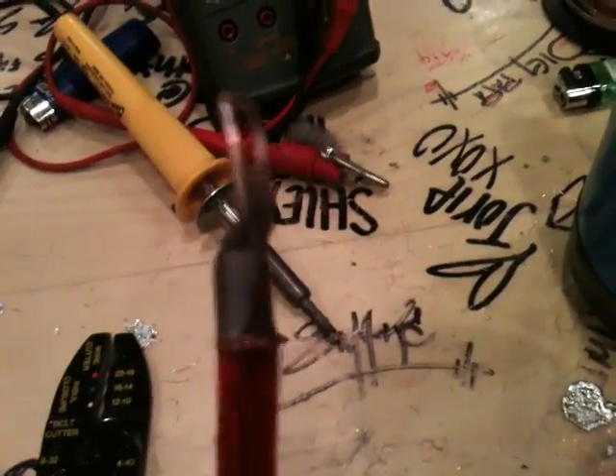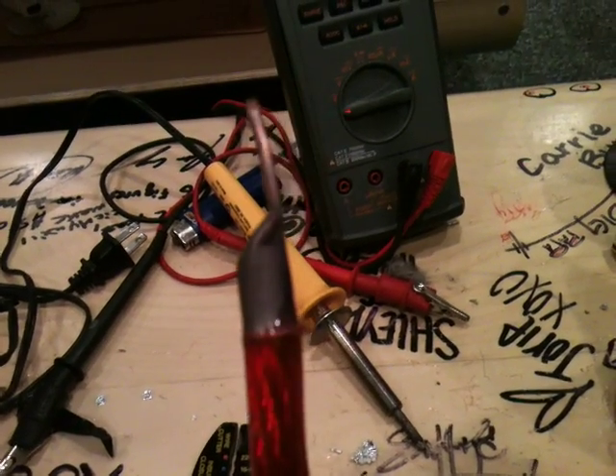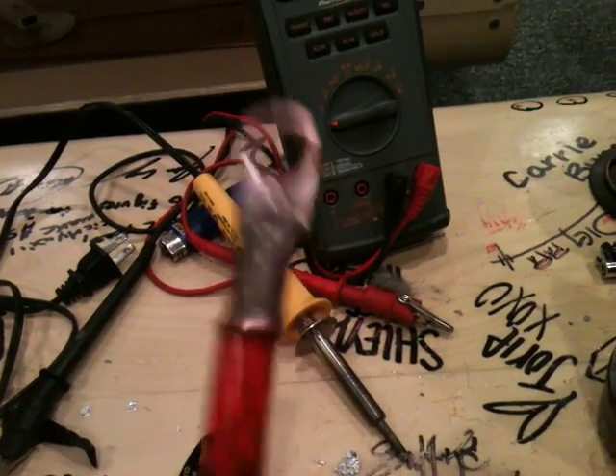Just waiting for this to dry — melted down the insulating part a little bit, it's a little discolored from the heat but it's not going to make a difference. Now just to show you how strong this connection is — take the wire stripper, I'm going to pull this pretty hard, and just so you guys can see: you will break the wire before you break this connection. It ain't going nowhere.